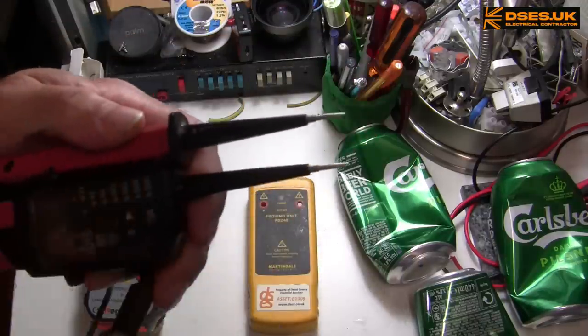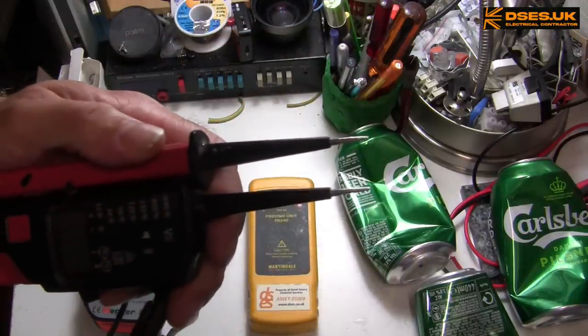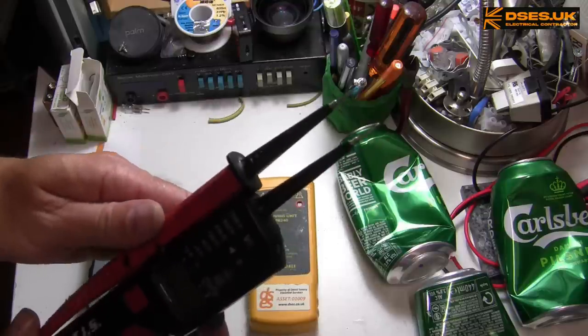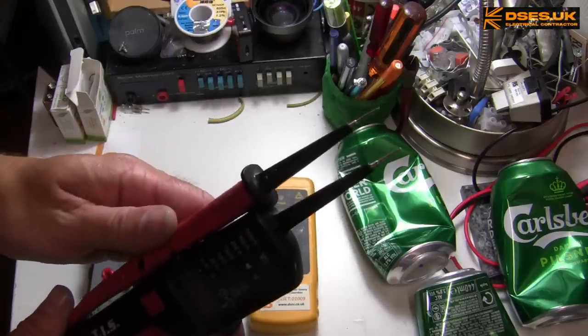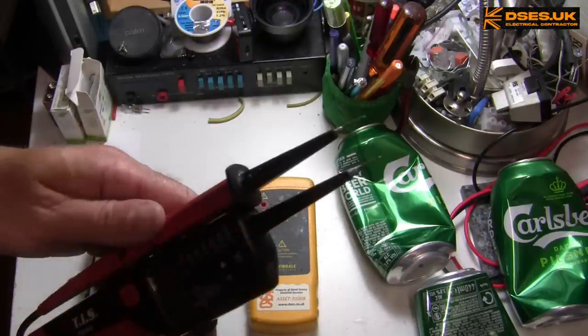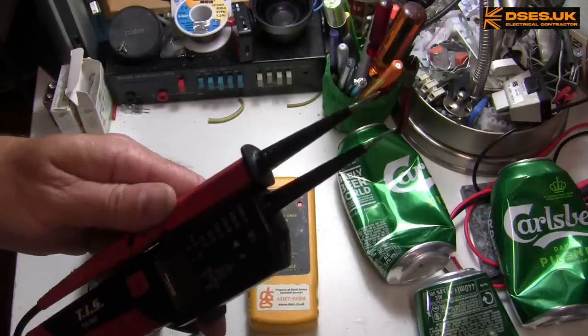Yes, that's 16mm of exposed probe tip right there, which will have the academic viewers in a fit of palpitations, because Health and Safety Guidance Note GS38 likes to see only 2mm of shiny metal, and wholly waves the naughty stick at anything over 4mm. Which is dumb as all shit, because 2-4mm ain't enough to satisfy anybody.